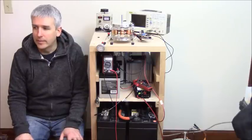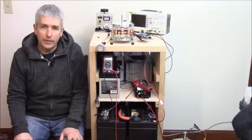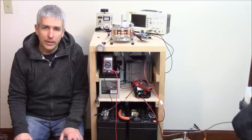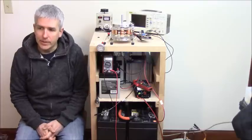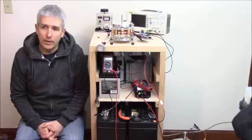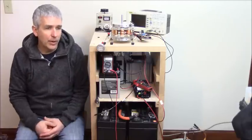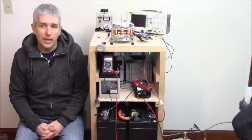But ideally, you don't want to just have constant current across a battery without rejuvenating it now and then with proper pulsing. But anyway, if you have a capacitor bank that's a decent size, then this kind of motor requires surge amperage pulses, and a power supply really can't handle that. They have their peak limits. So you'd want a capacitor bank to even all that out.